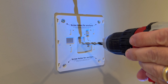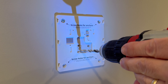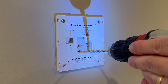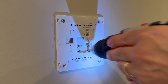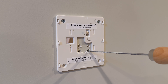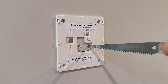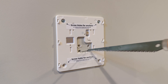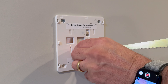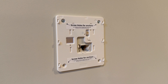Next we'll pop four holes in the wall here. What we want to do is break out this piece of drywall so that we can route the electrical circuit behind the wall so you don't see it. We'll get our drywall saw and cut this out pretty evenly. If you don't have a drywall saw you can just keep drilling holes until it crumbles. We'll clean it up a little bit — you won't see this at all so it won't be in our way.